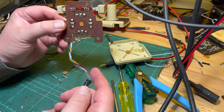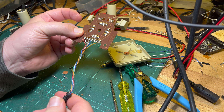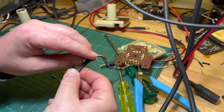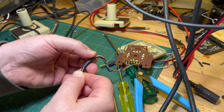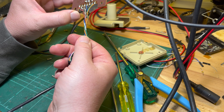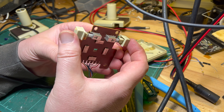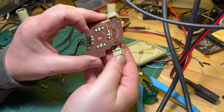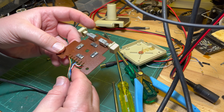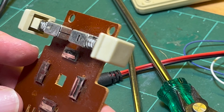So basically what I want to do is probably desolder this and then I'll be able to fit some heat shrink on to fix that there. Yeah, this looks like it slides as well. I'll stick some heat shrink on here to reinforce it. Let me take a quick photo so I know what colour goes where. For these switches I'll give them a bit of a spray with contact cleaner. Okay, got it desoldered. I'll spray some contact cleaner in there and see if that makes any difference.